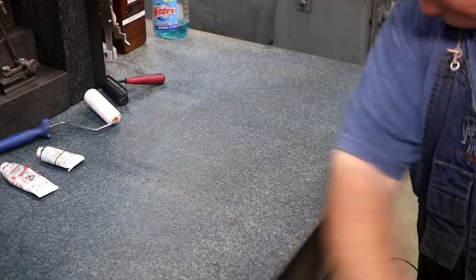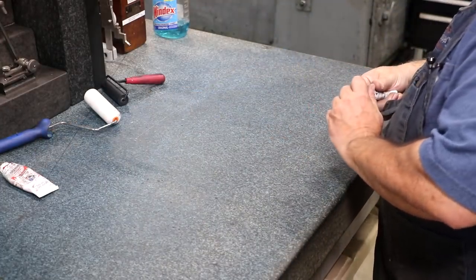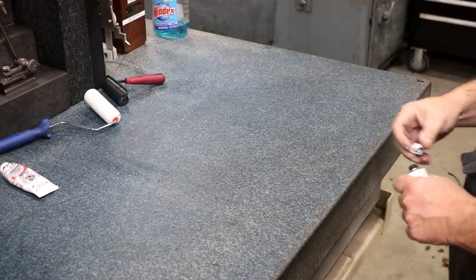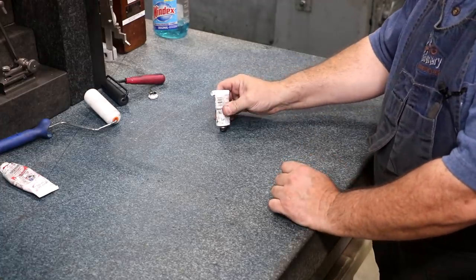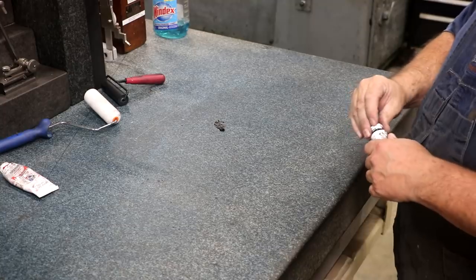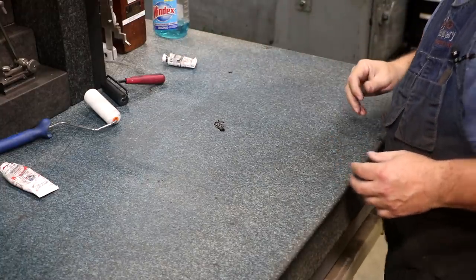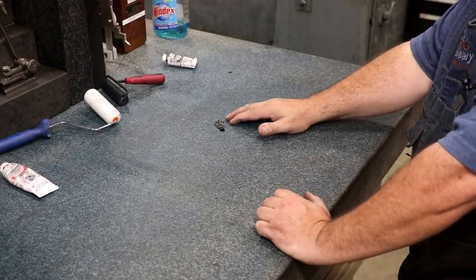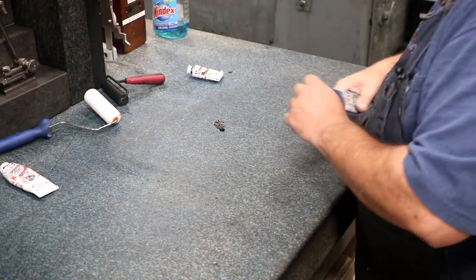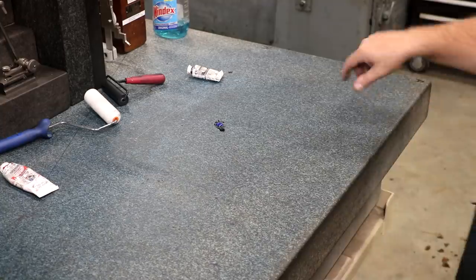I'm over at the surface plate now. The surface plate is a piece of granite that has been lapped extremely flat. This plate grades an A — over this three-foot by six-foot plate there is less than half a thou of variation in height from any place on the plate. Surface plates are graded in double A, A, or B grade; honestly for scraping any of those grades will work fine, but the higher the grade the flatter the plate and the flatter your end product. I'm putting some dye on here and spreading it out real thin. I like using this Aqua Wash ink and I mix it with a little bit of Blue Canode to thin it out just a little. I'll take a roller and roll it out.